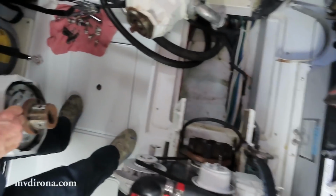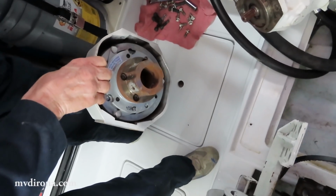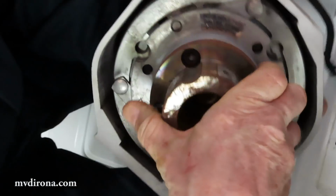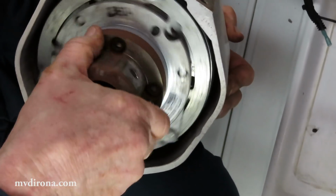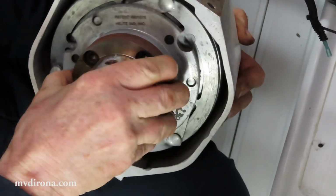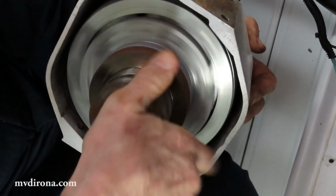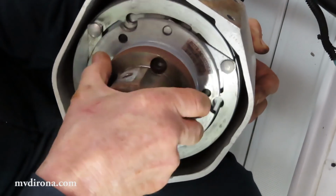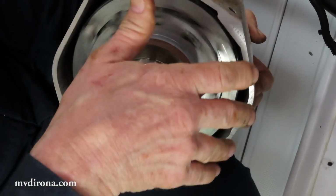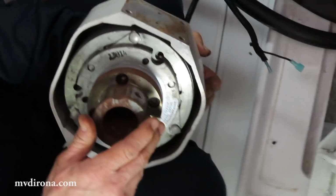There it is. And if you listen carefully, you can hear the defective part. How should it sound? It should roll nice and smoothly and shouldn't have that rumbling noise. You can feel it in the bearing. So definitely needed to come apart. Is that kind of scraping sound?